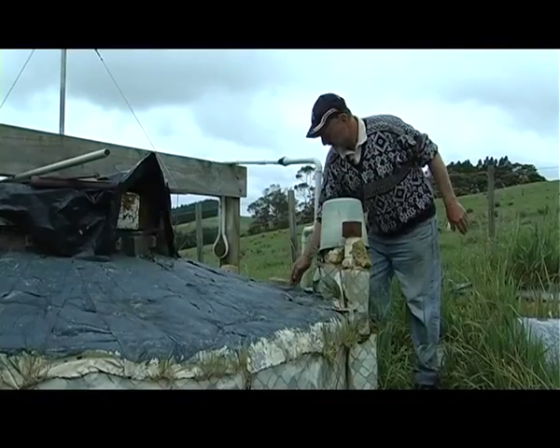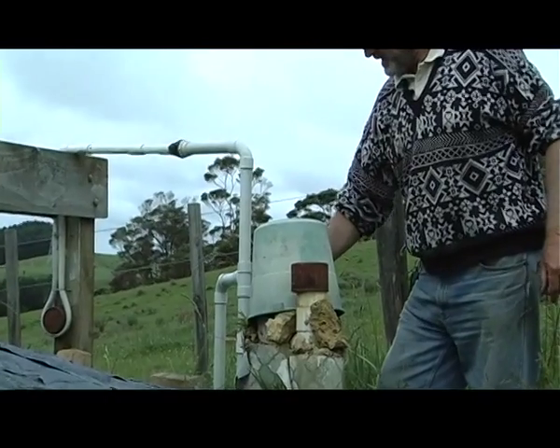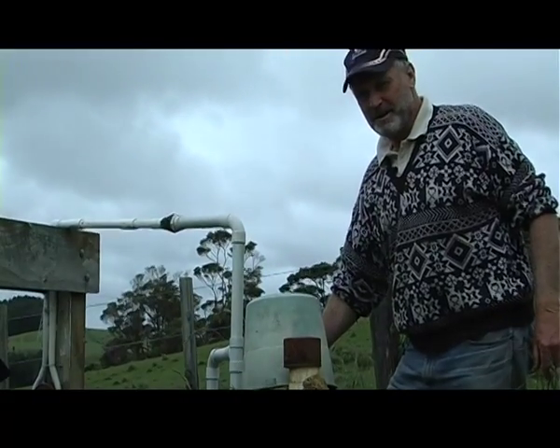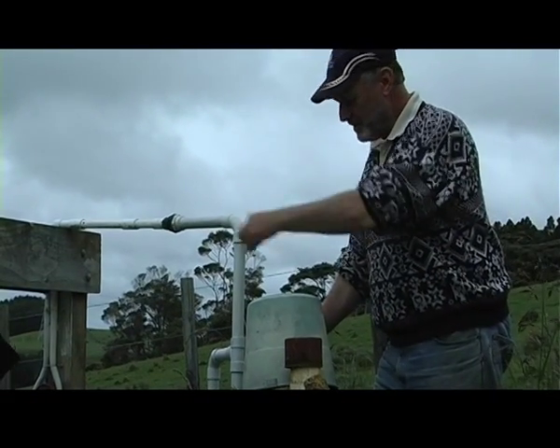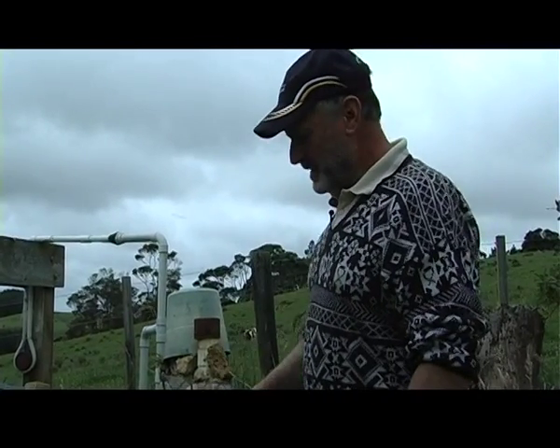Here's the pipe coming out of the foam into a T-junction, sitting in a flooded vessel for a gas seal. Any fluid coming down the moat goes the down route; the gas goes the up route. The gas pipe goes down into another vessel where the rusty cans are, where it strips off the hydrogen sulphide, and from there it goes out through a valve and hose into the gas bag. It works okay in the warmer months but everything slows right off in the cooler times.